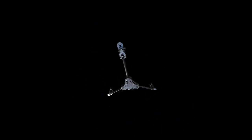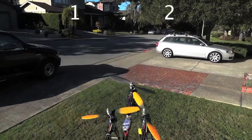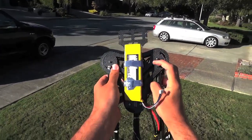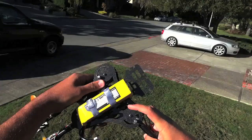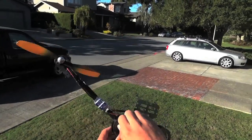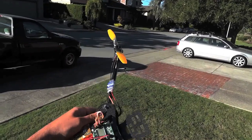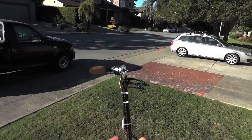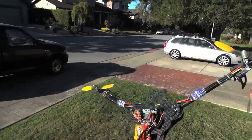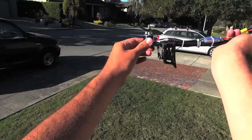The Tricopter is generally the lowest part count just due to the amount of motors and speed controls and props and so on. So one of its pros is low investment. It makes a good platform for cameras due to the front arms being angled out. You can generally get a pretty clear viewing angle. So minimal parts, minimal setup. There's a potential for folding if you buy, like say, the Talon Tricopter frame that has folding potential. So it'll pack up nice and small.